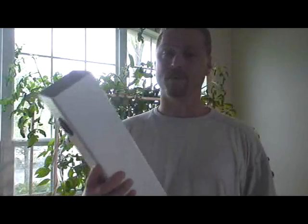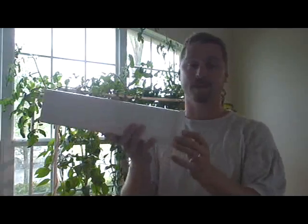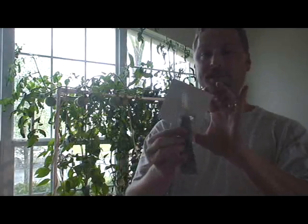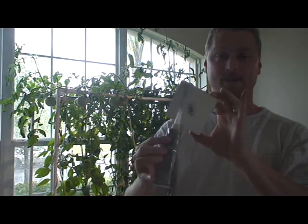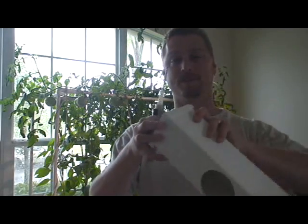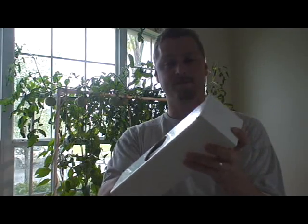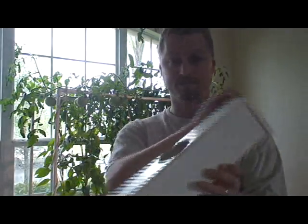Once you've got both bulkheads on, check that your measurements are there. Next thing is the end caps — we need to get that aquarium glue and let it completely dry. It needs at least three to five hours depending on the humidity; best to make sure it's completely dry. You're going to take your aquarium glue and coat the complete inside of your cap, all along the edges — a nice big thick piece. Once you get that in there, slide the cap on and hold it. If you can, put your hand in the other side and smear the glue around to make sure the seal's there. Just don't hit it after it's started drying. Do the same thing to the other side and you'll get your seal.